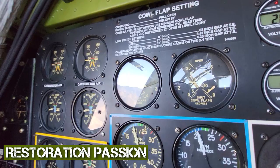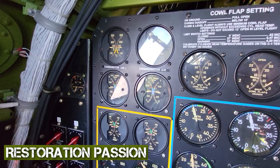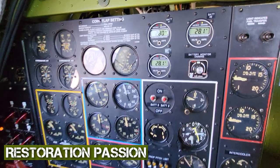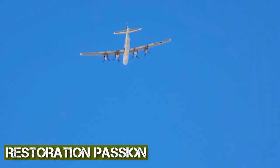Those big flaps on the side of the engine open up. Those are our cylinder head cooling flaps, cowl flaps. If number 3 is getting too low, I'll bring number 3 closed. You'll watch here. These are a little slow. They don't react instantly. It's a lot of guesswork. So you bring them closed, you be patient, and then you just trim the temperature where they're going.